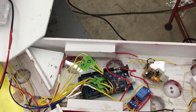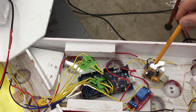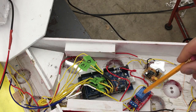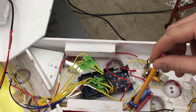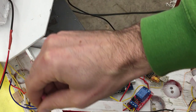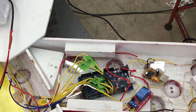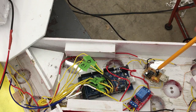Welcome to the brains of the operation. Our main controller is this Arduino Mega — the Mega just means it has more pins than a normal Arduino. This puts out 5 volts through these wires and controls the arrow lights that chase each other. This is the solenoid, and that controls the backlit part of the sign because it runs on 12 volts. So 12 volts goes in, then the Arduino sends a signal which trips the relay, which turns on the backlit sign. The outside chase lights were pulling too many amps — the Arduino does about 400 milliamps and this was pulling a lot more, so the Arduino kept shutting down. So I ripped apart a cigarette lighter adapter and this converts 12 volts DC down to 5 volts DC, which is what the LEDs run on.